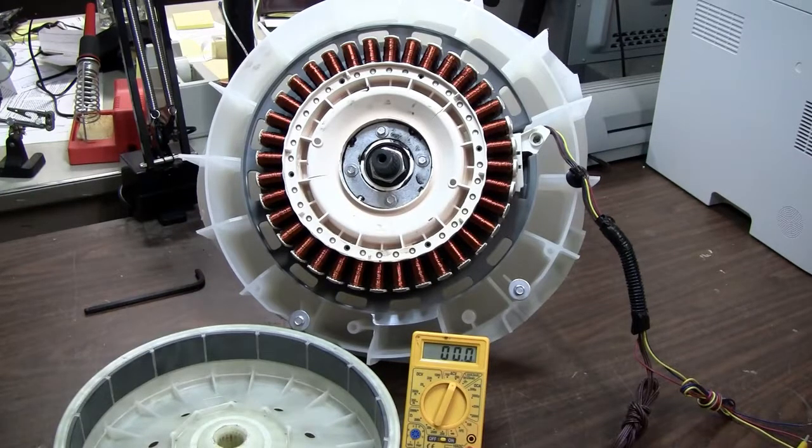First I would like to show you the rotor which at first glance appears to have just basic ceramic magnets, but if you look closer you will notice there is actually a laminated iron shield molded behind the magnets. I wonder what the significance of this might be — is this a magnetic shield or a way of providing more magnetic poles? I've seen this type of shielding before in something called the Quanta magnet motor generator hybrid as featured here on YouTube.